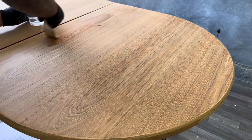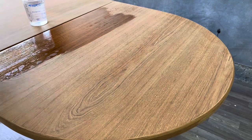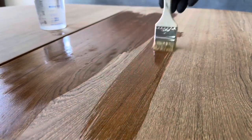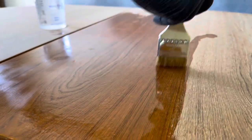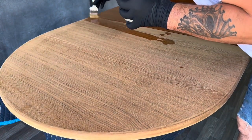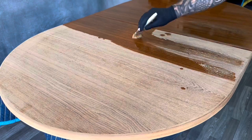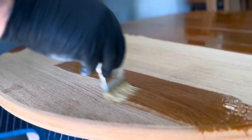As I was applying the oxalic acid, I could tell that it really wasn't penetrating the way it should be, because it still looked like it had some wax residue. You can see from that shot before that it looked like water obviously mixing with oil. It was penetrating the wood, but I wasn't having high hopes about this stuff, so we will see how it turns out.